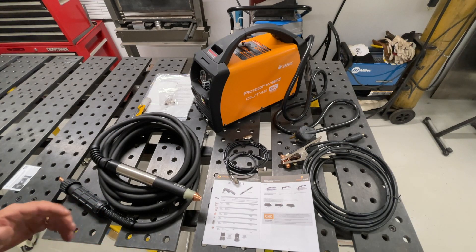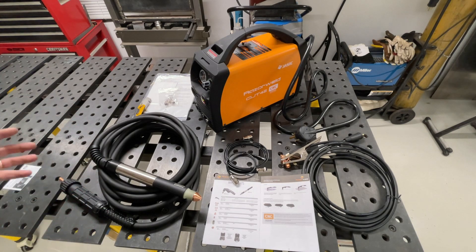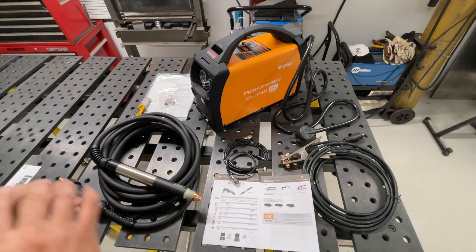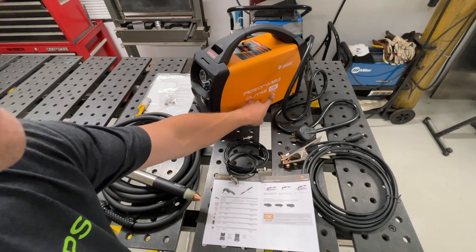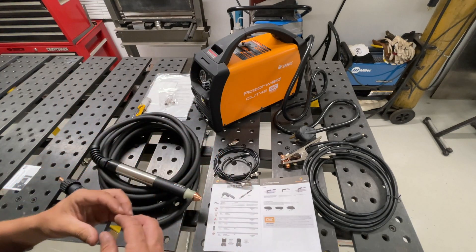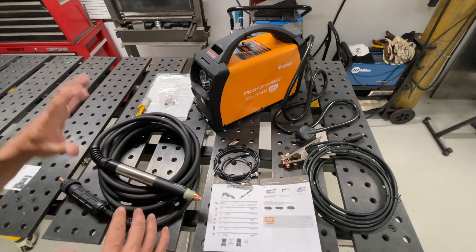On my Crossfire XR I plan on using the Razorweld 45. I used the exact same plasma cutter on my Crossfire Pro and always said I'd buy a Hypertherm when it died — and it never died. Let's take a look at this new Razorweld 45 with the machine torch. Visually it is orange, which is a little different. But here's a word of caution: if you're going to order one, make sure your Razorweld 45 says 'CNC Crossfire compatible' on the side, because if it isn't, it might not have the two ports on the front or the cables — one that turns on your torch and one for torch height control — that make it plug-and-play with the Crossfire XR or Crossfire Pro.